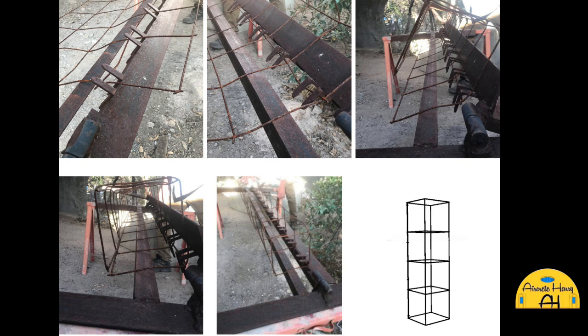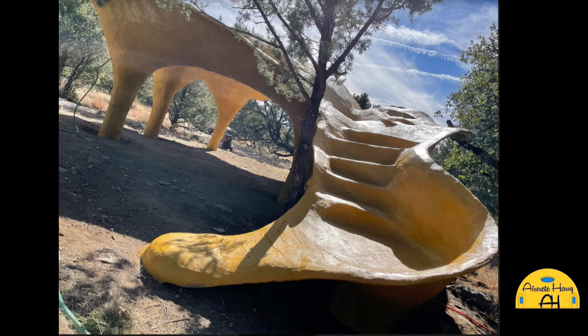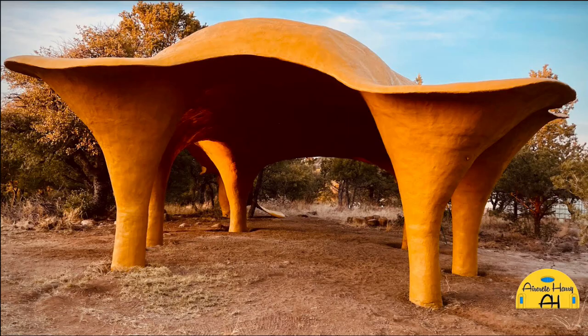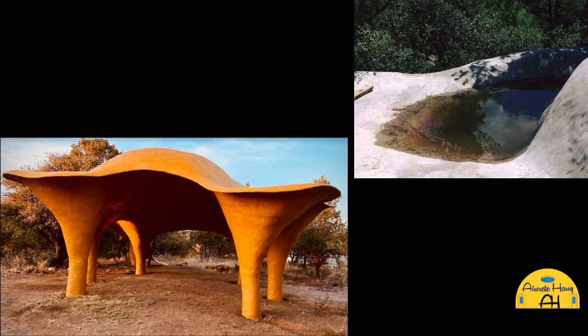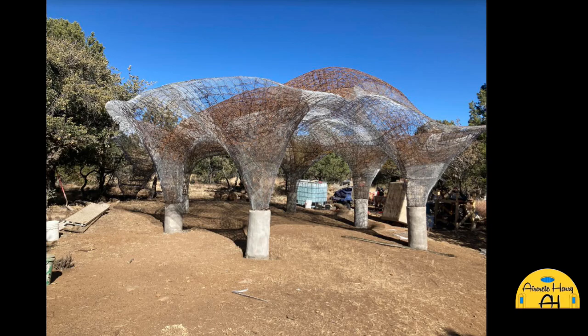And that's important. Normally a ferro cement water tank has like a 10-20 year lifespan, whereas a water tank made with something like this is just not going to get weaker. Who knows? I spout out numbers that go really out there, but we don't really know. But we know that it's not going to be damaged by chemical expansion because of the aeration, because it's a kind of aircrete. And it's not going to be damaged by ice, and it's pretty strong for the impacts. And so yeah, it's probably going to stick around.